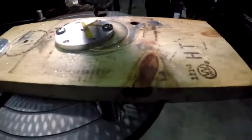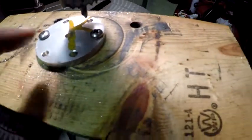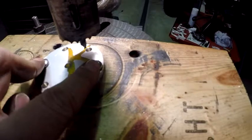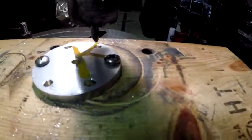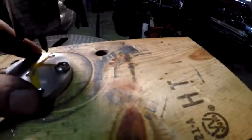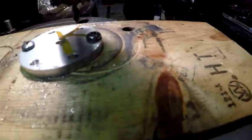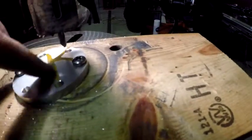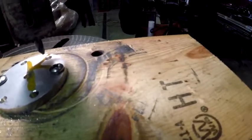Here's what I do. I use that sacrificial piece of wood again and drill two quarter-inch holes to hold bolts down in there. If you have to, you can drill bigger on the back side and throw nuts in there to hold everything tight. But I haven't had bad luck — especially with aluminum — that if you just sink two in there long enough, they stay in place. Then you go ahead and hole-saw that middle out. It's going to move some. I'm going to clean them up in the lathe.